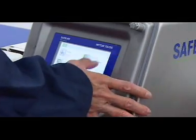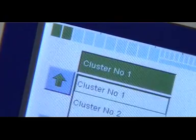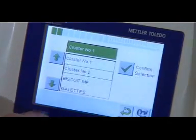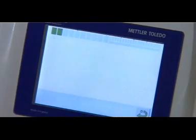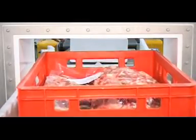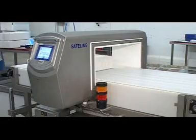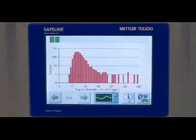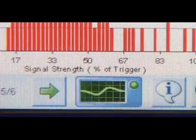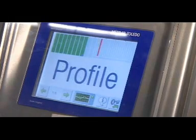Production flexibility can be enhanced using multiple frequency models, which allows different products to be inspected using a single metal detector. Single, dual and triple frequency detectors are available depending on the manufacturer's product inspection requirements. R-series detectors use digital signal processing and the most sophisticated electronic filtering techniques combined with robust mechanical construction to deliver maximum sensitivity and stability.